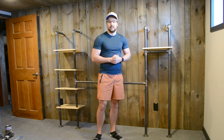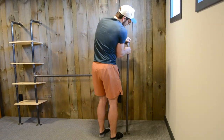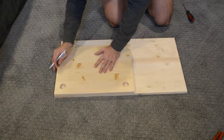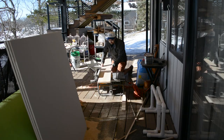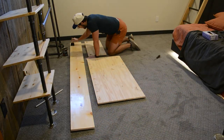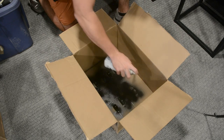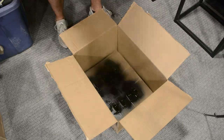These are the sorts of decisions you don't want to make in the moment, but every day after you'll regret not making them. After cutting holes for the new shelf, I ripped down a 1x10 to create a shelf that spans the entire top of the desk. I then applied polyurethane to that new shelf, the existing shelves, and the desktop, which is a 2x4 panel from Home Depot. I also found pipe clamps to secure the desk and top shelf, and sprayed them black so they disappear.